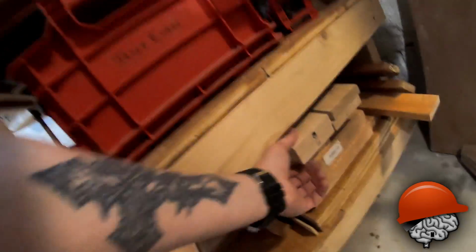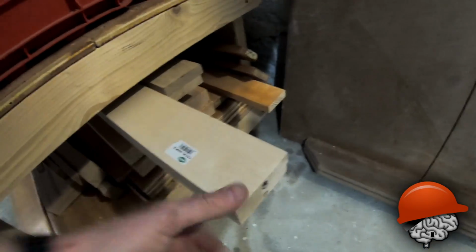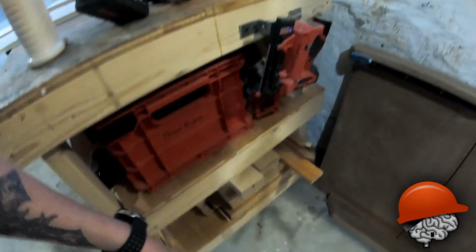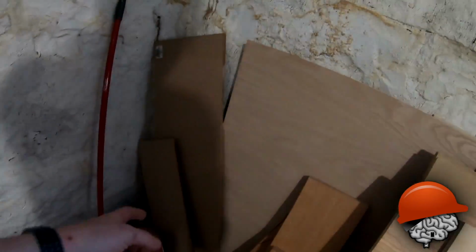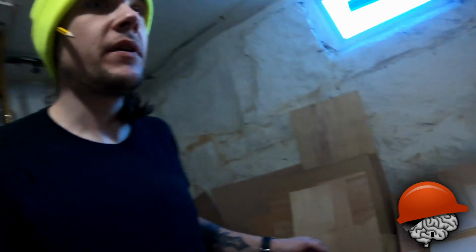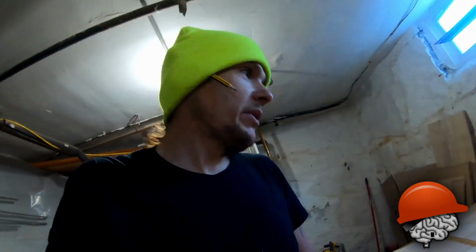So the face frame, I got some hard maple right here, because that's what the other cabinets are. He's gonna hire a painter to come in and just sand and paint everything, so I don't even have to worry about that. Nice. And the center panel, it's actually a raised panel door, so I got some half inch MDF, which we'll make the center panel out of. I think it's much safer.